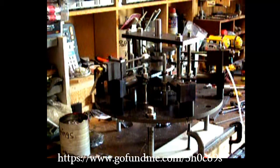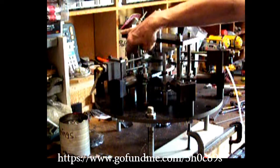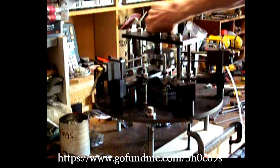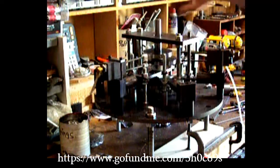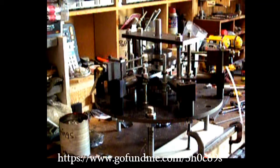I've been working on my valves for the last week or so, and I finally have three of them made and installed. I can see that I'm going to have a problem with balance. I need to come up with a way to balance the things — I believe it's because of the eccentrics here that operate the valves, because the other stuff should be all balanced.